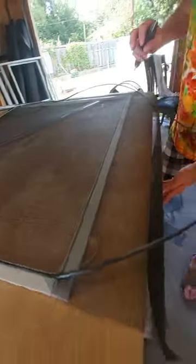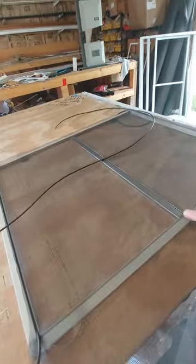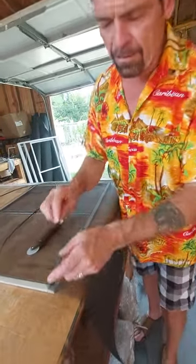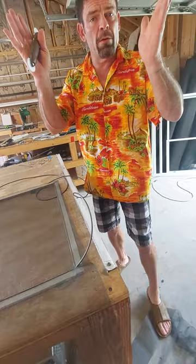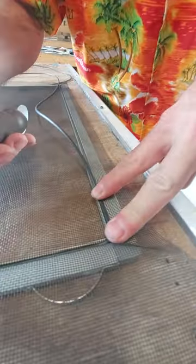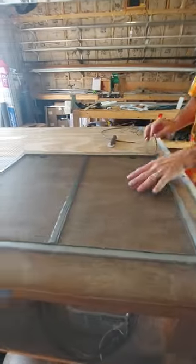Whether you're doing this at your kitchen table or a picnic table in the backyard, it's completely up to you. I'm going to take my crossbar, which I've already pre-cut, and turn that corner again. Spread my fingers, concave side. But this time instead of pulling down the line, I'm actually just going to pull out — just slightly — to take away any wrinkle, softness, or anything loose in that material. Because besides having a frame that's too tight or giving it an hourglass figure, the worst thing is having one that's really floppy in the wind. Now spin this around, concave corner, drive it down — and we have ourselves a perfect, flawless bug screen.